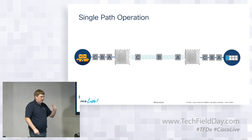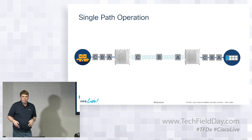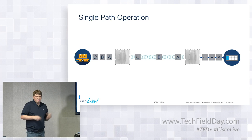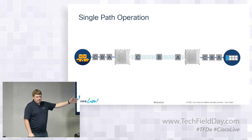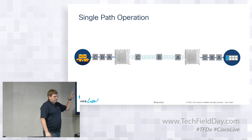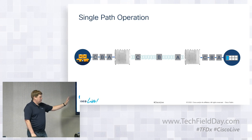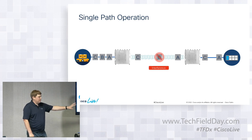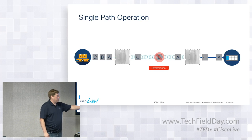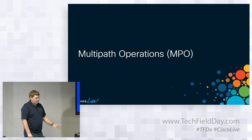This is what we have today with single-path operation. You have an AGV on one side and a PLC controller on the other. You send packets across — they're a little more spread out due to latency and the shared wireless medium. Today, if you have interference, a packet might only be sent once. Something happens and it doesn't get through — that packet is lost. So what is Cisco's answer for that with our industrial access point?